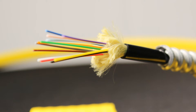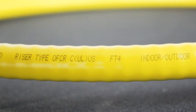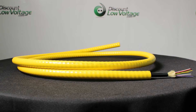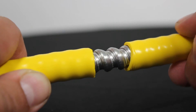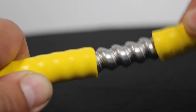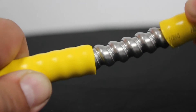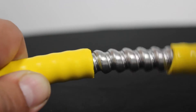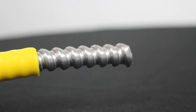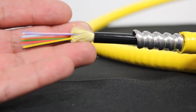This is your OCC indoor/outdoor 12-strand single mode interlocking armored riser-rated cable. It is NEC listed for use in vertical runs in building risers or from floor to floor. It features aluminum interlocking armor with a PVC overall jacket. The interlocking armor can be easily removed, leaving an intact inner cable — ideal for locations that require conduit for cable protection.